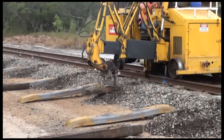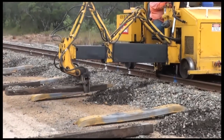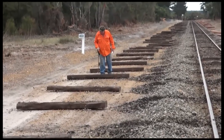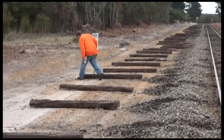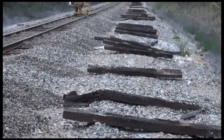This is done with a gemco machine. The condition of every existing timber sleeper that was removed from track to make way for a steel sleeper is then assessed. If the sleeper is in good condition, it will be reinserted back into track during the timber re-sleepering run. Failed or life-expired timber sleepers are discarded.